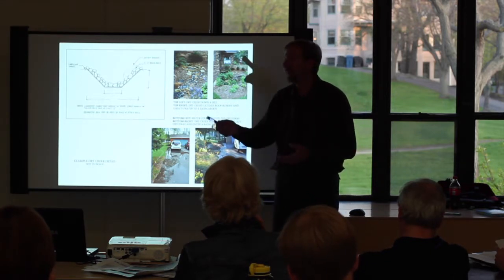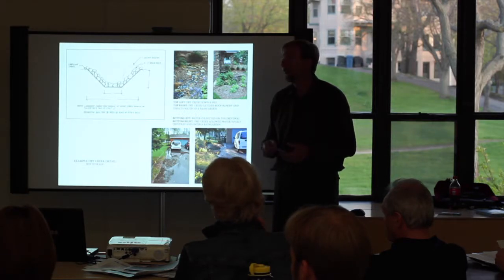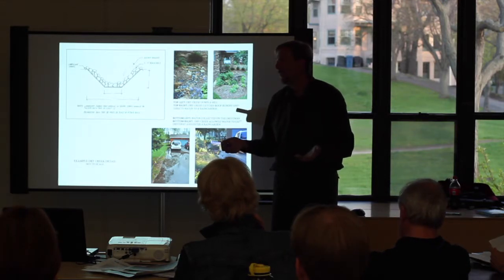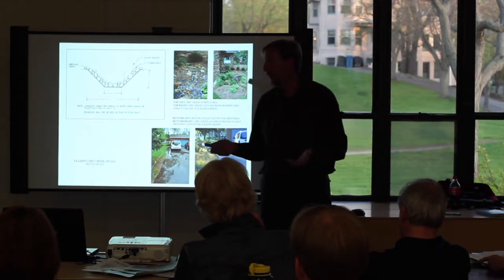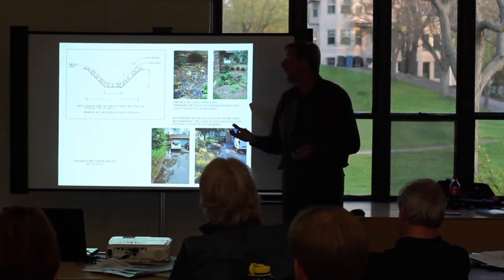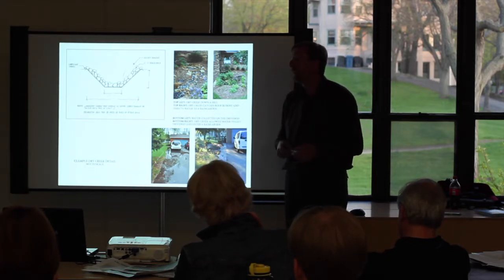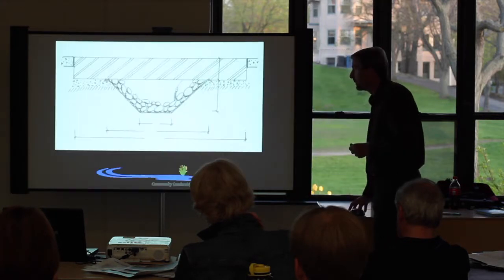It's back to aesthetics. So it's possible also to do a grassy swale, like between my house and my neighbor's house. You just have a grade slightly lower and then have maybe fescue grass that has better roots or something? Yeah, you can, or sod. Fescue is no better than Kentucky bluegrass for root depth, but the grass is fine, and grass works just fine. It's more of an aesthetic reason to move that water in the soil.